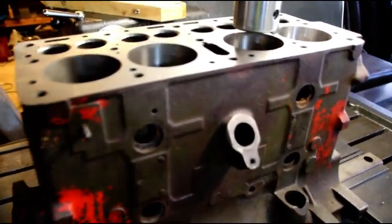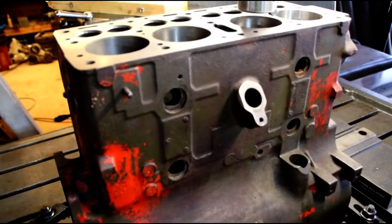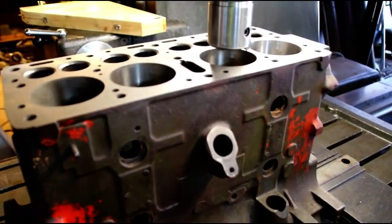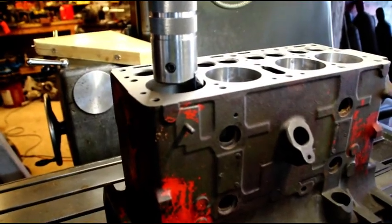This is going to screw up my two-to-three distance, which should be 4.938. So basically I'm going to have to center up on every hole. We'll see after the second one gets bored where we wind up, but let's get moving on this and see where we go.